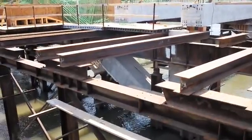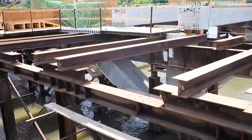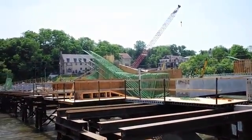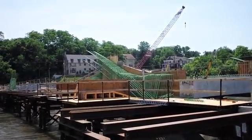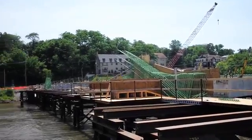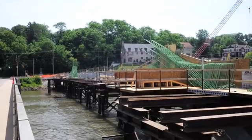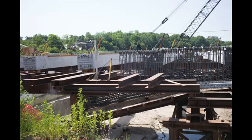Then down here you see it coming up from the water and going up above where it's reinforced by the green re-rod. And then you can see that it's going to form an arch that goes all the way over to the other side. Right at the center of the photograph is the enormously thick maze of steel reinforcing rod that will be covered by concrete when it is poured to form the beams that run parallel on either side of the bridge.